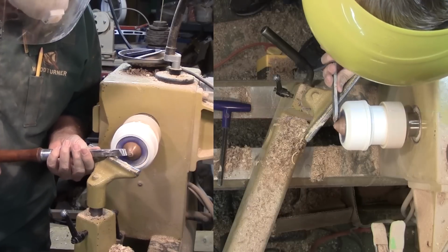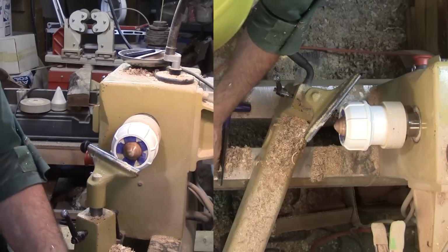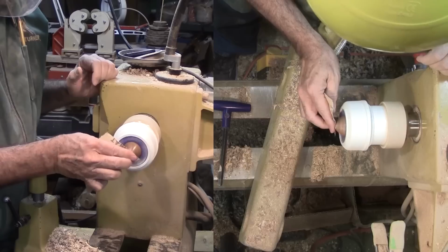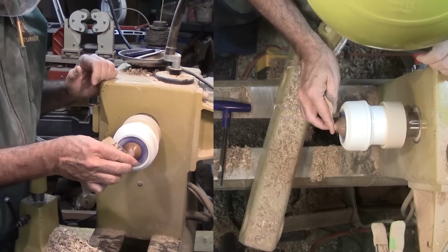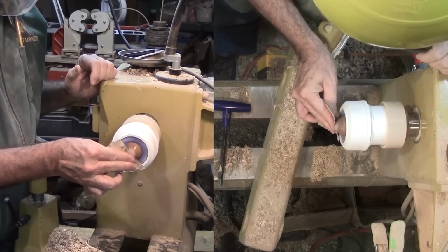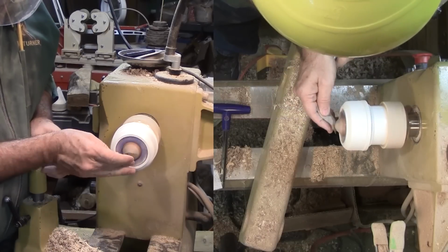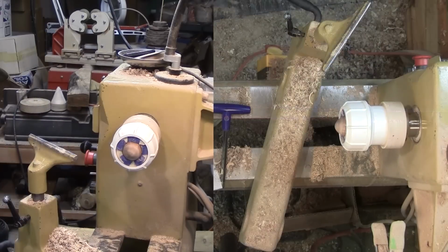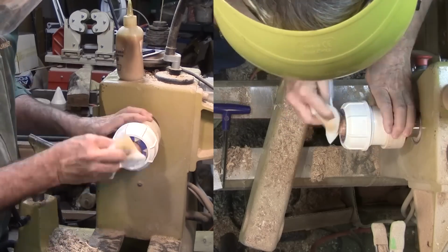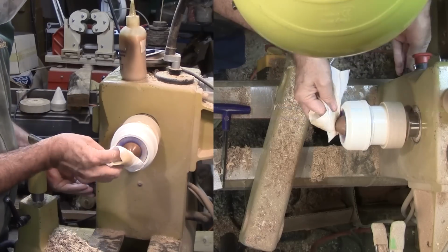I'm already thinking of potential enhancements to this chuck. Smaller eggs will require different top plywood rings with a smaller tapered hole, a bottom plywood disc with a smaller hollow, and more or different spacer discs at the bottom of the chuck. This chuck does not require a band clamp with its risk of injury to my hands. The 2-inch PVC connector cost me about $10 at my local Home Depot store plumbing department. The 1.5-inch connector was about $3 less, but then maxes out with a smaller egg. So get the larger connector.